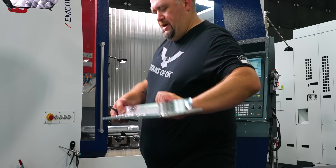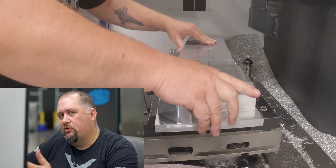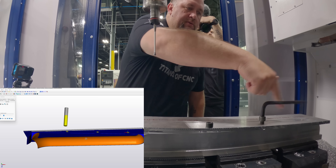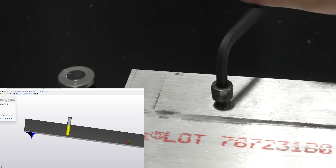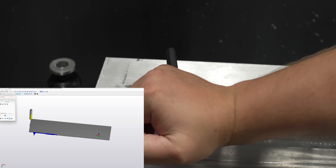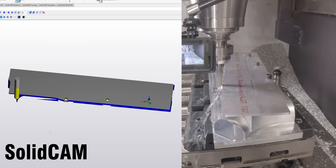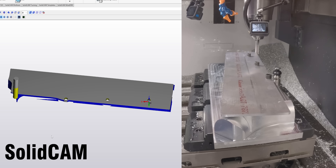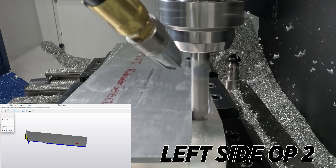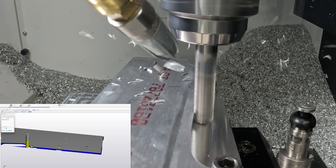This is the first part that I've programmed in SolidCAM, and I've been really impressed with it coming from Mastercam. Let's take a look at the order of operations for the second operation. We have all of our fillets on the underside machined and we have this hat on top of our material, so the first thing I'm going to do is remove that hat. I could have just roughed it out using a full slot strategy and tabbed that hat on with an M0 stop for the operator, but personally I prefer to leave the machine unattended without any manual stops. So we're going to turn that entire hat into chips.